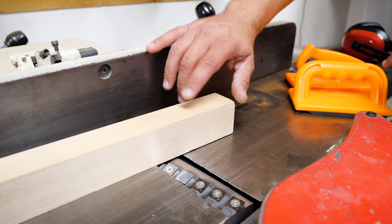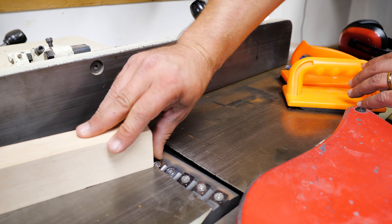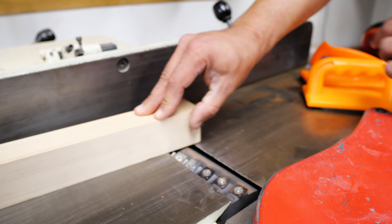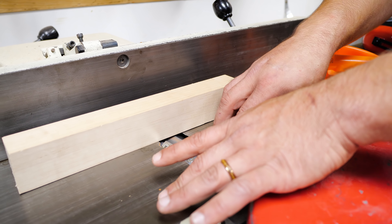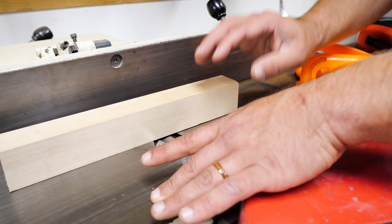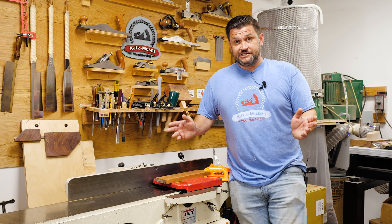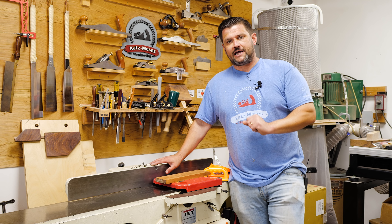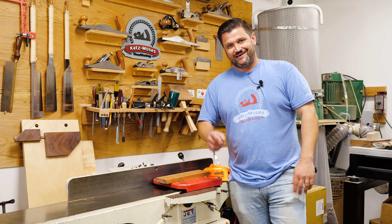One important thing when pushing a board through: people have a tendency to put their hand or push block behind the board, and that's really dangerous — if you slip you can catch the cutter head. Always push from the top on your outfeed table. Make sure your beds are clean and waxed; a little bit of wax or 3-in-1 oil will keep the board sliding easily. If you take too deep a cut it can be really hard to push, and that's where you get into trouble. So keep the cut light, keep your beds clean and waxed, and don't put your fingers behind your board. Jointers aren't much to them — pretty easy to use if you follow basic safety. I'm also going to do another video on how to joint boards without a jointer, so make sure you hit that subscribe button. Stay safe in the shop, thanks for watching!